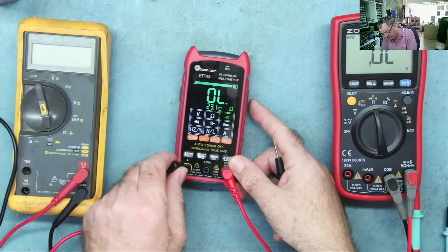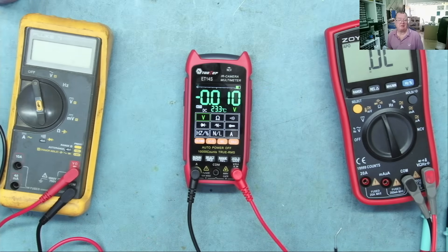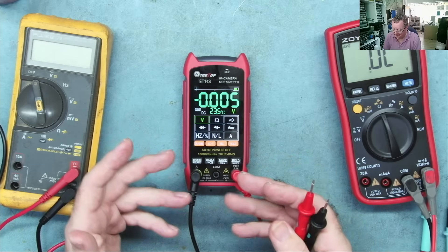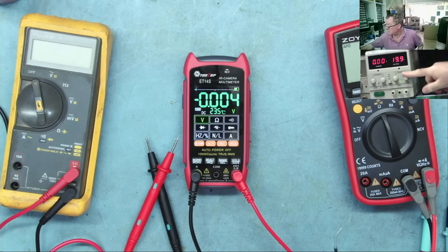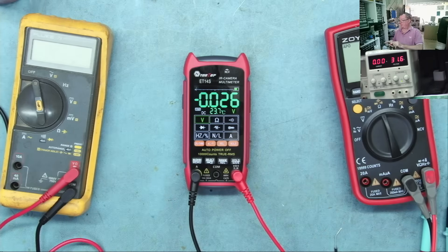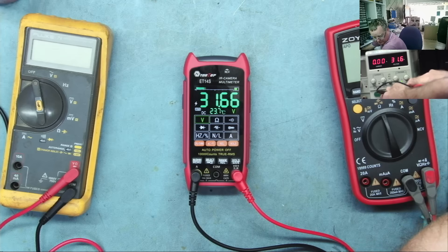While we're on the topic — can we measure volts on the amps connection? Because with a multimeter the voltage input is effectively a very high resistance, but when you're on the current range the multimeter is a very low resistance. So what happens if I take my bench power supply, turn it up to 31 volts — the maximum it will do — and connect the multimeter on the amps connection to the power supply? It just reads 31.6 volts, which is correct.